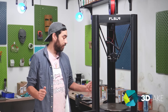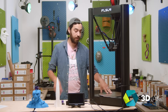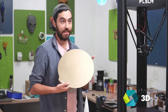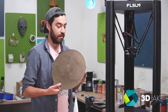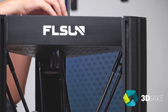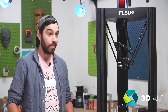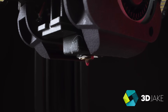So basic details first. The build volume is 300 millimeters in diameter with a Z height of 410 millimeters. We have this lovely PEI plate which is absolutely awesome. I'm so glad they've done this because the last one, the SR, had a glass plate which I'm not that fond of. I just love how PEI plates are becoming the norm now. We also have a filament sensor up here. These can be a little bit finicky but we've tested numerous times and there's no resistance putting filament in — super smooth. It also has a dual drive gear extruder and an all-metal hotend with a bimetallic heatbreak that's good up to 300°C.